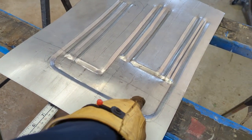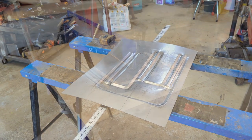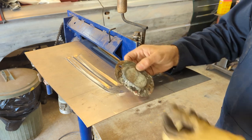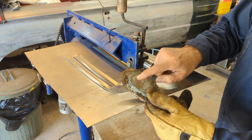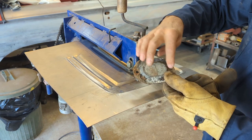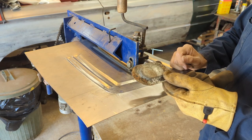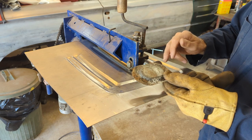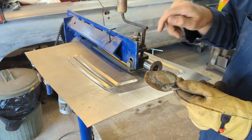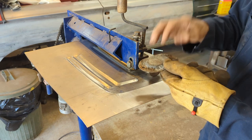Once I get this down, it'll straighten this panel out a little bit more. Now I'm putting the drain hole in. I took some radius tools, measured that and transferred it onto the plate, using the bolt holes as reference — the forward hole is the baseline for all of this panel. I've got the joggle dies on again and I'm just going to joggle it around. These just have a little lip that drops down, and the panel sits on top — the opposite way that the lip is.